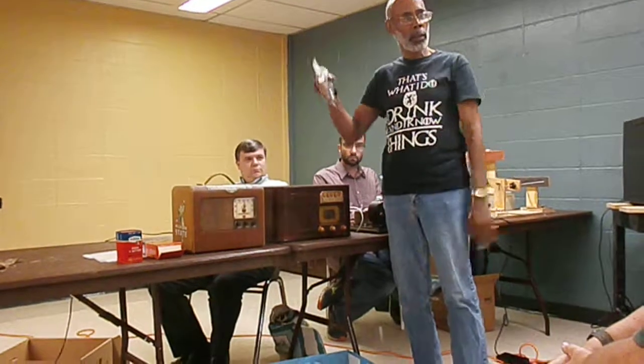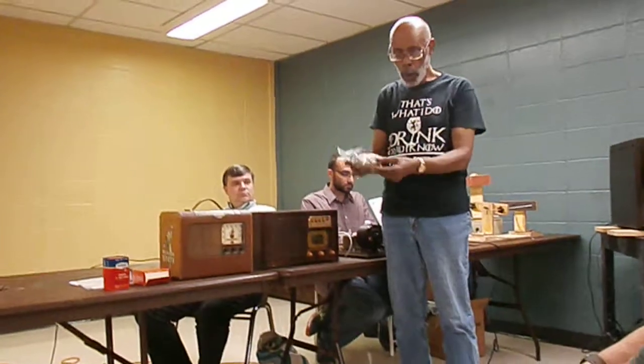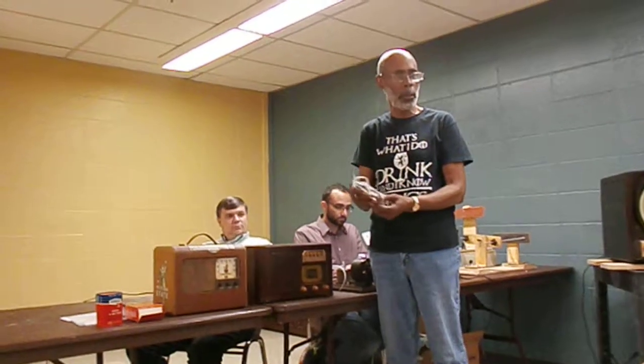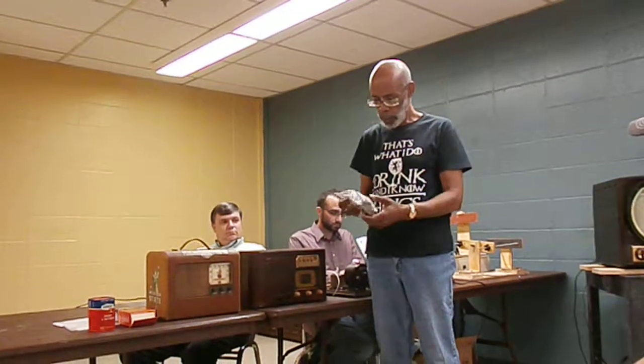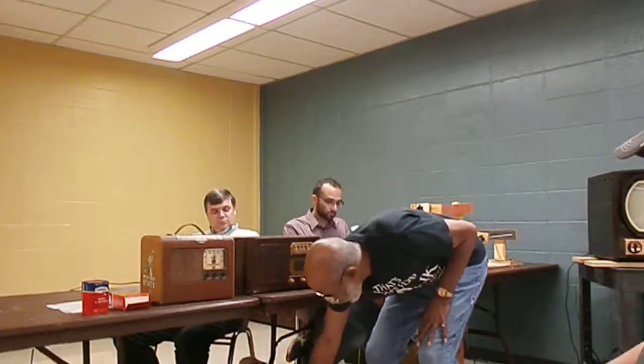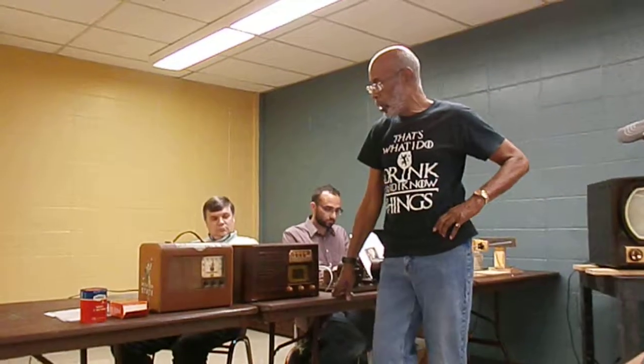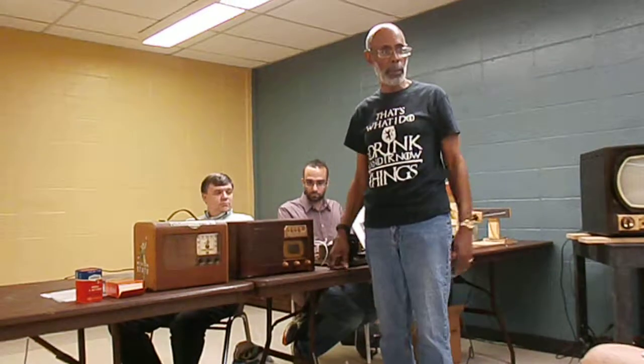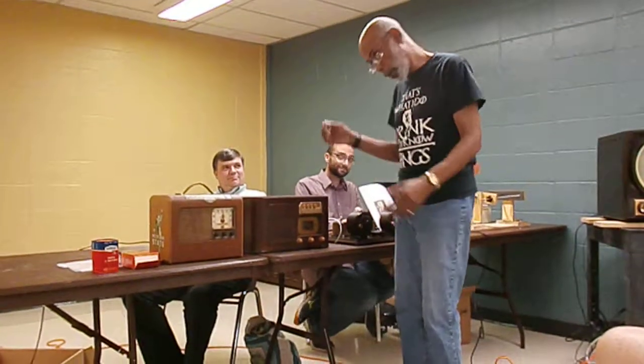Had all Zenith caps in it. I don't have all the caps in there, but I figured I'd bring them in there, all the Zenith caps. And they bought some caps from other people. There were some other ones in there. And I did my process of changing caps, and there weren't a lot. There might have been 10 maybe. Every time I put a cap in, I test it. Every time I put another one in, I test it. I'm not bold enough to go in there and just snatch everything out, put everything in, and then hope that it works, because if it doesn't, you don't know where you made your mistake. You save a lot of time. Yeah.